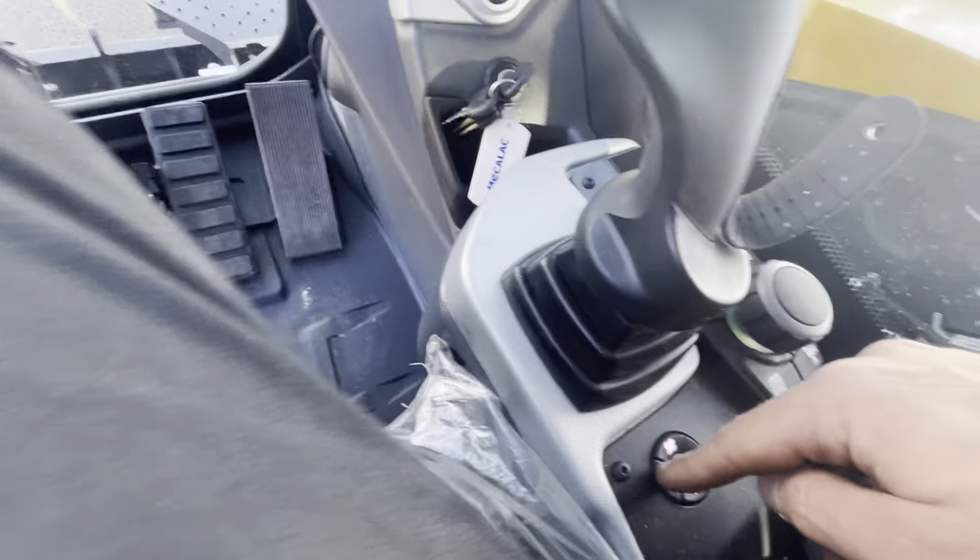So here you've got your menu button — you can come in here and change your settings. So you've got excavator here; we can go in and change our different options, what buttons on the joystick we can configure, etc. The biggest thing for you to consider is attachments — you come in here and we can change the attachments. Your post driver can't have any more than 40 litres per minute, so you have to select this mode: 40 LPM when you're using the post driver. When you're using the Engcon, you come back and select the Engcon. If you put 100 litres per minute into your post driver, you will damage the hammer — 100% you can't overdo that. So we've got a sticker here for you, and there's one on the post driver as well. Just keep that in mind when you pick the post driver up — you need to select the post driver as an attachment in here. You can rename these — so you can call it 'post driver' if you want.